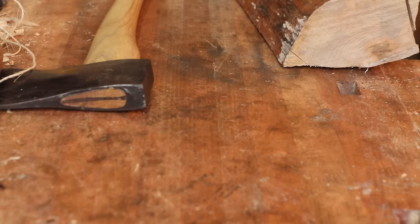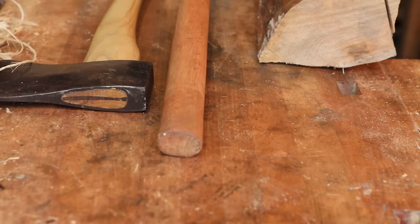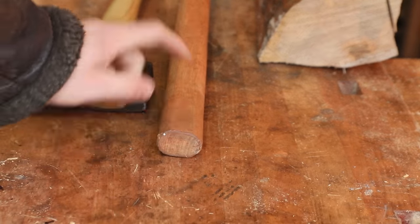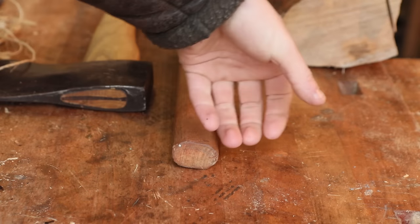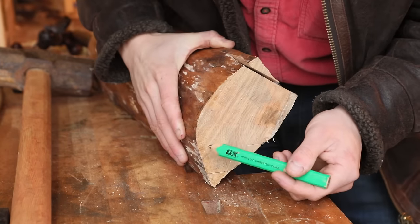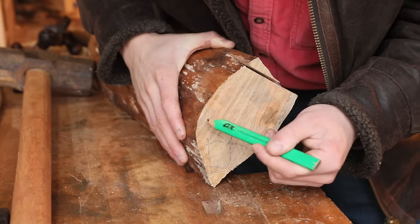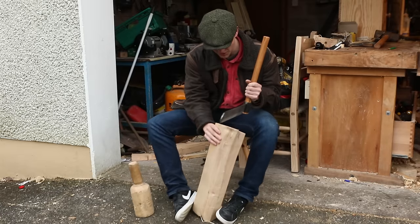I've done it with this one. An example of a poorly handled sledgehammer is this fellow here — you can see the grain is running completely perpendicular. It's grand, it'll do the trick for a while, but the grain is more likely to crack along there than it is to crack sideways. What that means for our axe handle is that we want the end to be facing from this section here as opposed to out of this section.